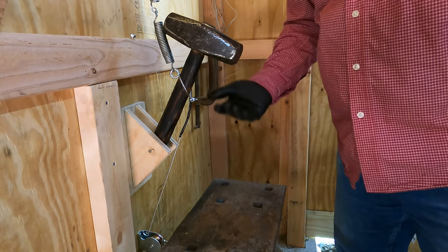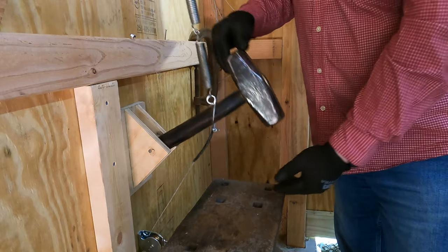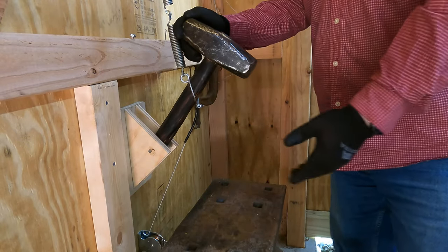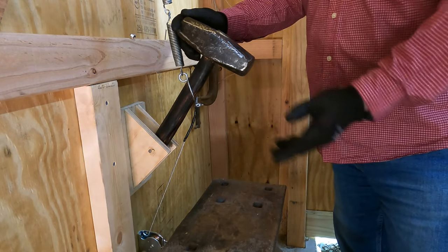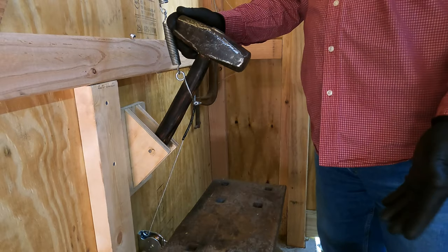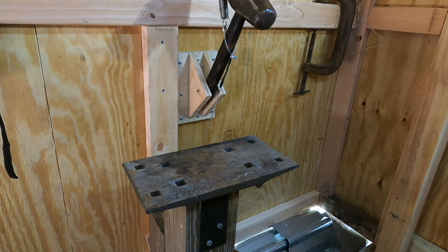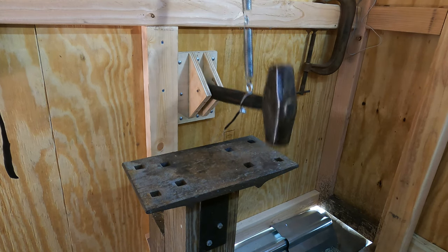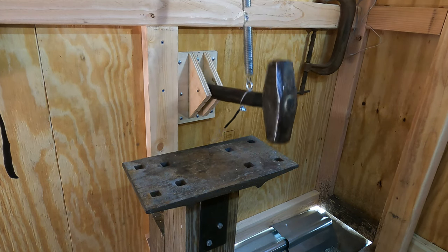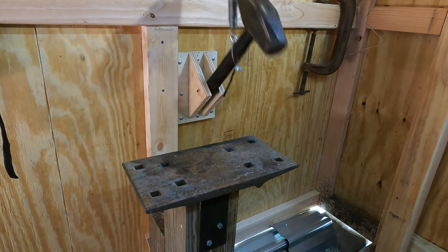There's a good foot of space to work here now. Obviously, you can move this mounting piece up a little higher if you want the hammer to strike at a certain height — say if you're using a stamp or top-end tools and you want the actual face of the hammer to be perpendicular to the surface. You just move this up — simple as that. Running it with the foot pedal, you can see how immensely different it looks from version one. Version two brings big improvements: better hammer travel, a lot more working distance to the piece, and it looks better personally.